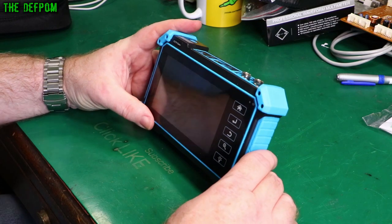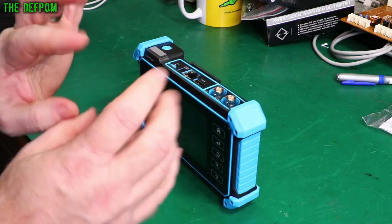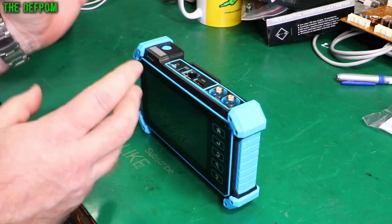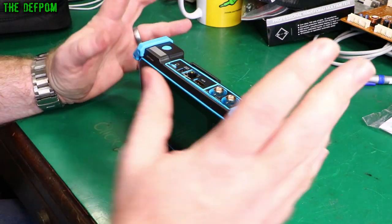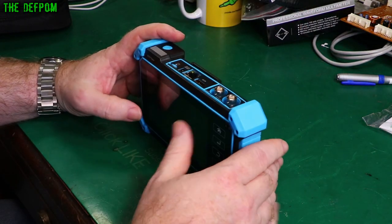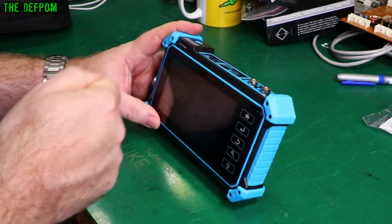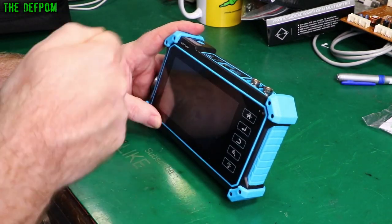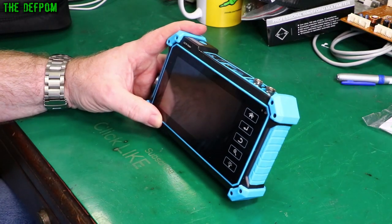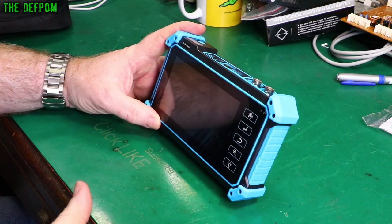And that mistake was that I took it off. I was doing something else — I can't remember what I took it off for, I think I was trying to probe something else, I needed a cable for something else. And then when I put the cable back on here, I forgot to put the DC block back on. And then I was carrying on probing around thinking, I'm not getting a signal now, I was getting a signal there before, where's it gone? And I thought, what's that smell? — and when you get the 'what's that smell?', it's always a really bad sign.